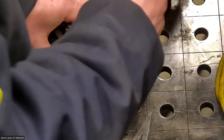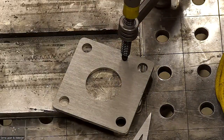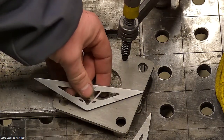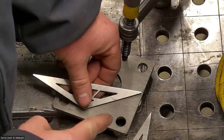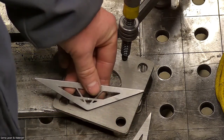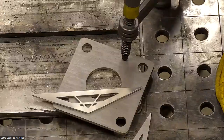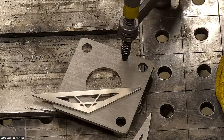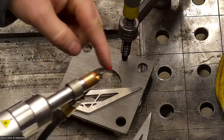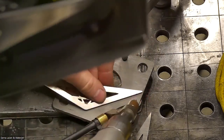I have my wire speed set to about 70 centimeters per minute. You can play with this — increased wire speed might help the wire race to the material so you don't break contact as easily, but I've gotten the hang of it at the factory wire speed of 70 centimeters per minute. I also don't have the right wire on here but for demonstration purposes it'll work the same — this is steel wire. Let me tack this up.